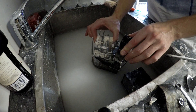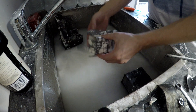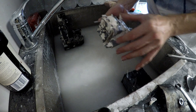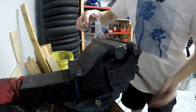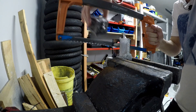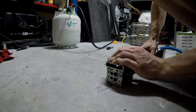Hopefully it'll come out now — it's so complete, that's just awesome. Now to get the rest of this off it. Because this one is actually not crap, I will cut all the sprues and gates off. The only thing left is the coolant jacket — I need to try to get the investment out of there. My plan is to use compressed air.